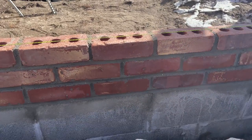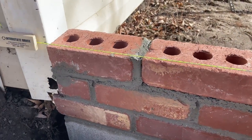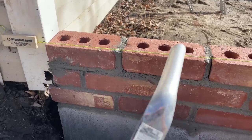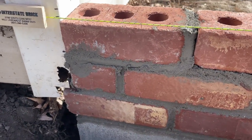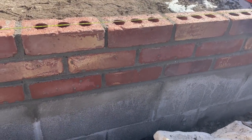I just want to show a little progress on the brick here. The grout was looking rough at first and I was a little worried, but once you get your joiner — which is right here, a brick joiner — you just go around and smooth the verticals first, and then the horizontals. So it goes from that to this. It looks so beautiful — it's exactly what I wanted, the character.